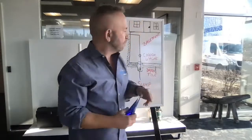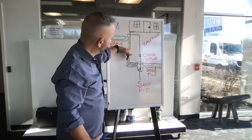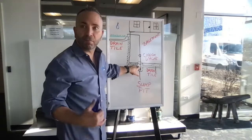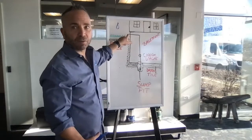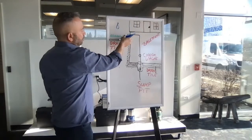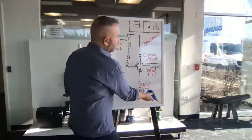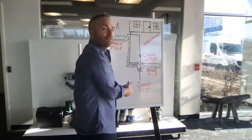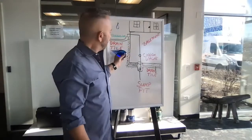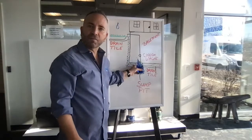That water tries to migrate towards the basement of the house — the foundation — and it starts migrating sideways right towards the house. The whole purpose of a sump pump pit is to take that water as it pushes against the concrete. It falls down to what's called a drain tile. The drain tile then takes it to a sump pump pit, and from there we take a sump pump and pump that back up and out of the house. It comes out of this pipe and goes into another drain tile, taking it away from the home.